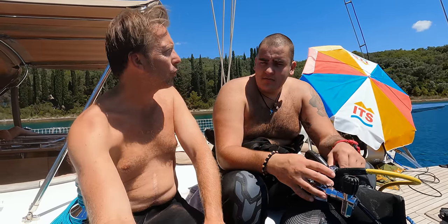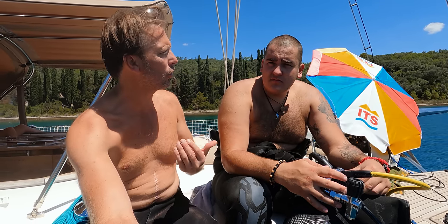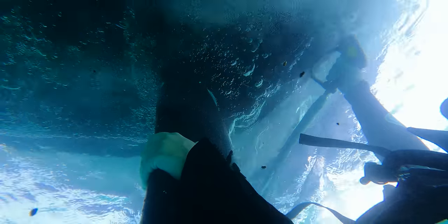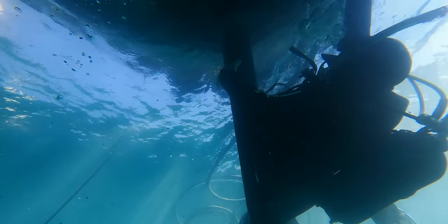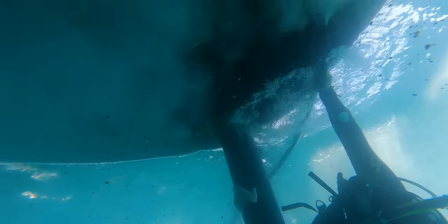Yeah. I only have the comparison with the copper coat we had on it before. It was also hard to remove with the Scotch Brite and the spatula to get the stuff off. And how is it for you to compare normal antifouling, copper coat and Finsulate? I can tell you honestly that Finsulate is much easier to remove any kind of dirt. Like I was showing you the small round shells, it's the hardest thing to remove from the boat. And from Finsulate it's so easy.